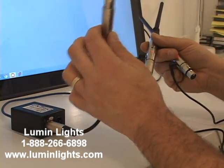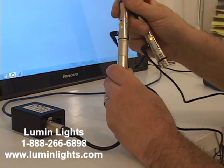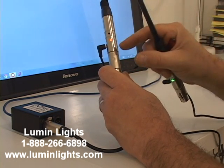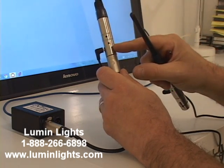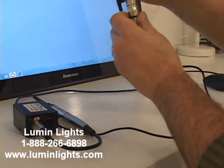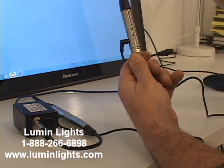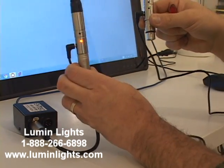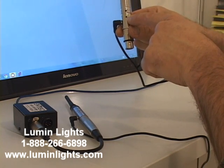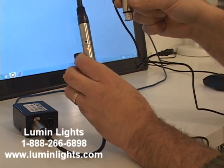It all depends on whether they're getting a signal from the input or receiving a signal from their antenna. Right now I have a signal coming from my dongle box, and when I plug the stick into the output, it starts flashing red because it is getting a DMX signal and that signal is turning this into a transmitter. It's blinking because it's transmitting through the antenna. This other unit, which is not plugged into anything and not receiving a DMX input, is listening through its antenna — and because the first unit is transmitting, this unit is picking up the signal and blinking green to show it is receiving. So blinking red means you're transmitting, blinking green means you're receiving.